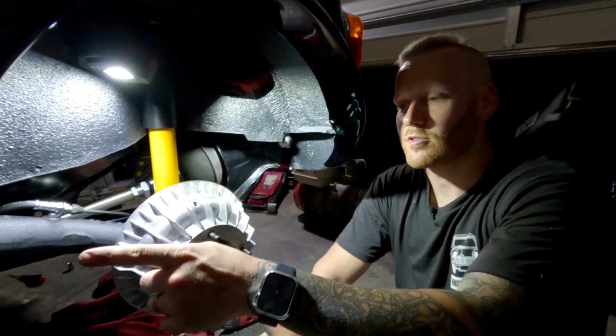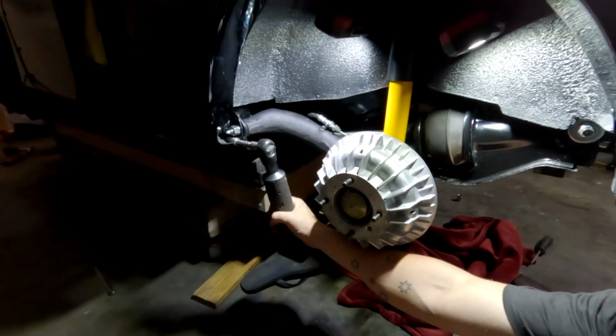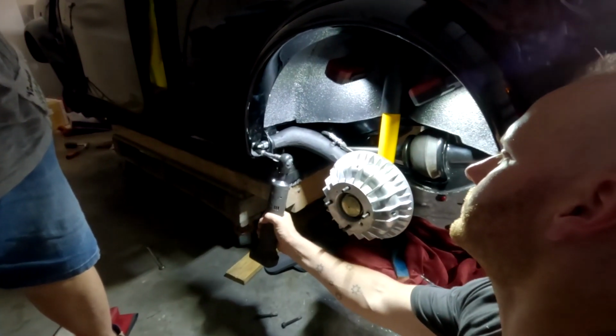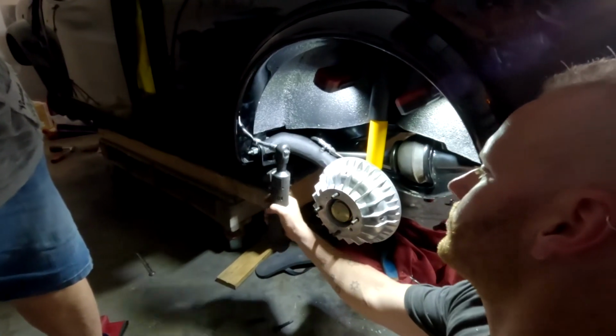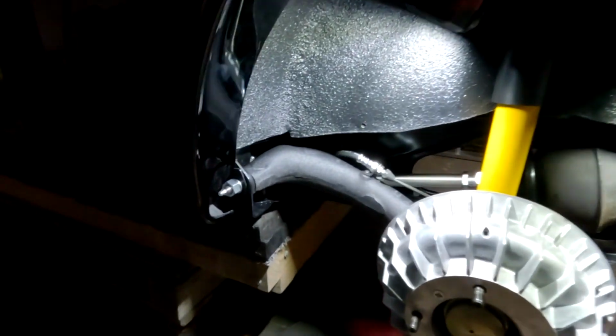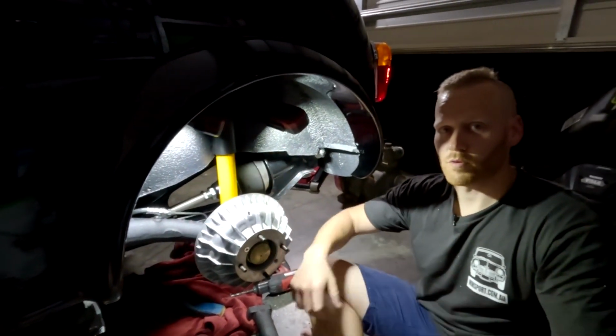So the last thing we need to do is just tighten both of these bolts on either side for the front part of the rear subframe. There's 2 1/2 inch bolts. That'll pull it straight in. Do the same the other side, then we'll go back and we'll recheck all 8 bolts, make sure that they're all tightened up. Once they're tightened up, we can then move on to the next job.